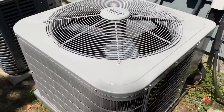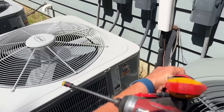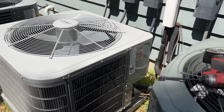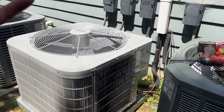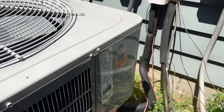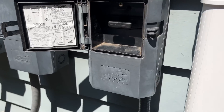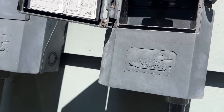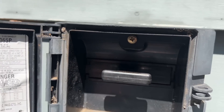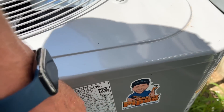The unit is not running. I use the Service Pal mobile dispatching and invoicing app — it also lets me take payments right from the app. There's the unit we installed, there's my sticker. First thing I'll take a peek inside. It looks like I'm going to need a fill-up. I'll take off this cover to see if the contactor is pulled in and if I've got 240 volts.